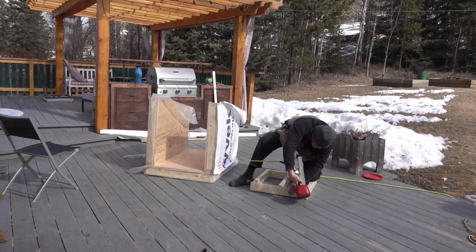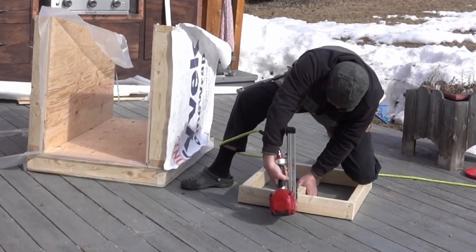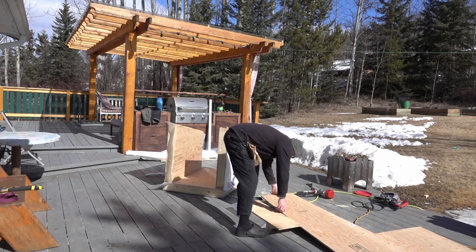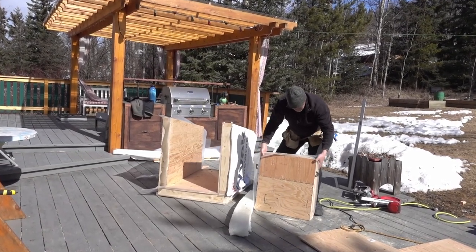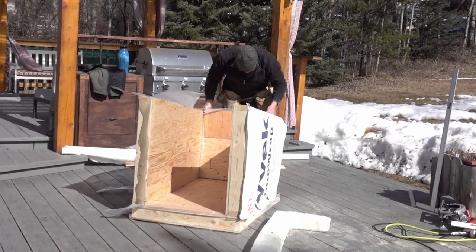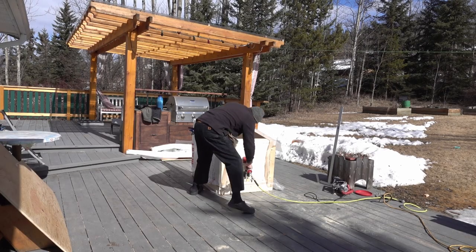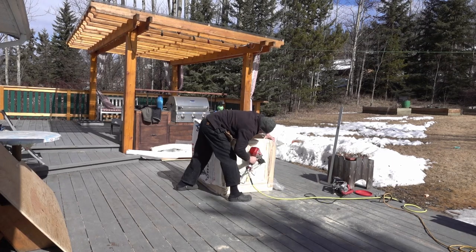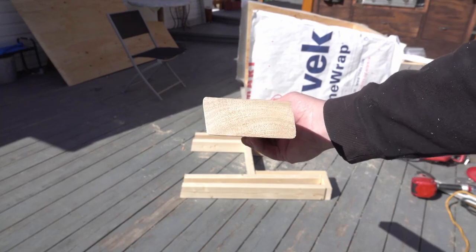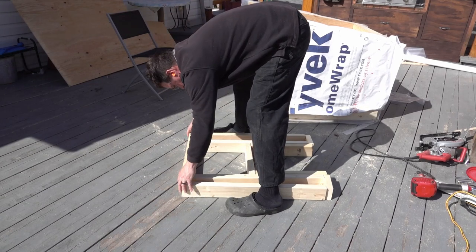With the sidewalls in place, I had a pattern for the back wall to be framed using the same plywood, poly, insulation, and Tyvek process. The end wall then could be secured to the floor and sidewalls using 3 1/4 common air nails. Both front wall and back wall header plates had to be trimmed to a 10 degree angle to allow the sheeting to sit flush against the 2x4s. The front wall has the opening to allow Shamrock in and out.